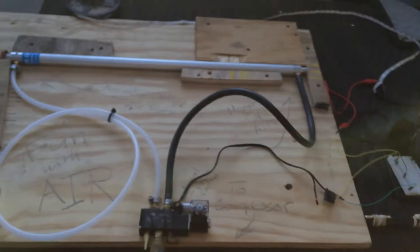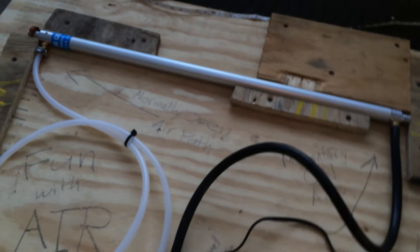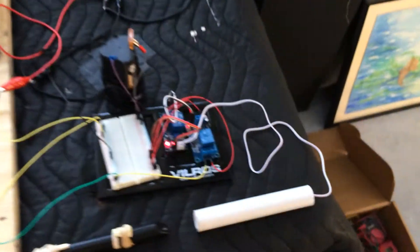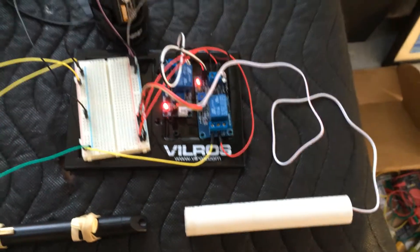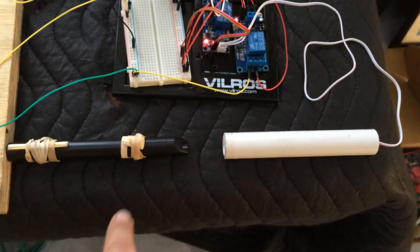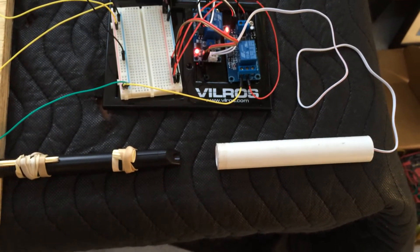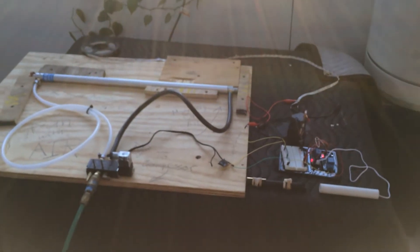So that's the idea — that's the mock-up, the prototype. Of course, it needs a second air cylinder and actually being attached to the two halves of the pocket door, then just mount all the stuff together into an electronics enclosure. Maybe give this a black tube to make it look nice, maybe get laser diodes instead of just using a laser pointer I already have. But that's it — that's my Star Trek door working prototype mock-up.